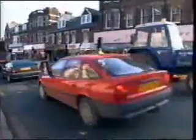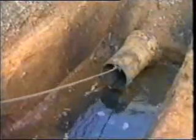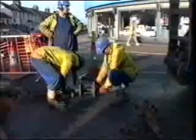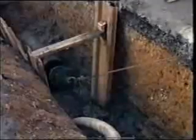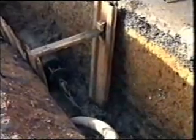Due to heavy incrustations inside the pipe, it was decided to use the drag scraping technique for cleaning. This consists of 2 winches working in series, pulling various sizes of steel scraping pigs inside the main until all the incrustations have been removed. A rubber pull-through is then winched through inside the pipe to remove any fine debris left after scraping.